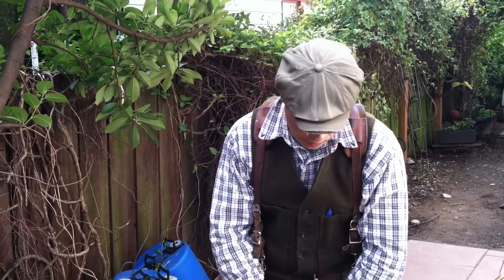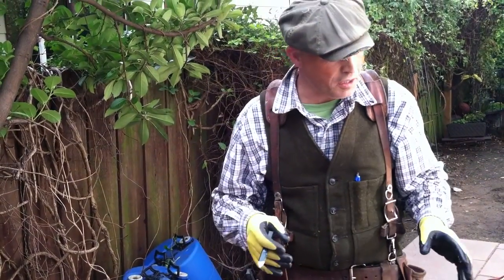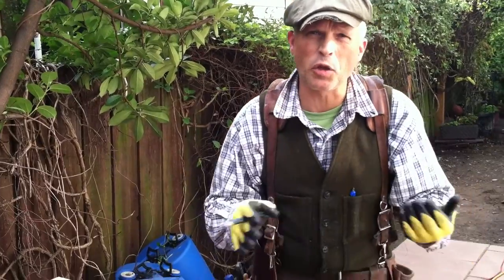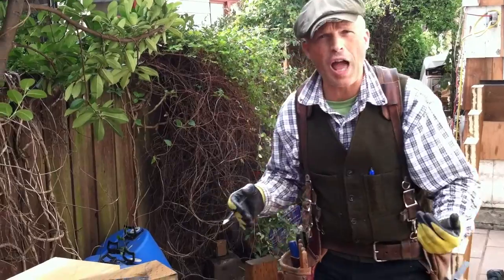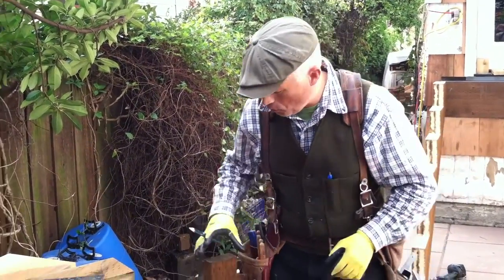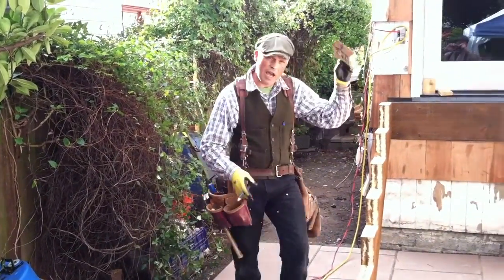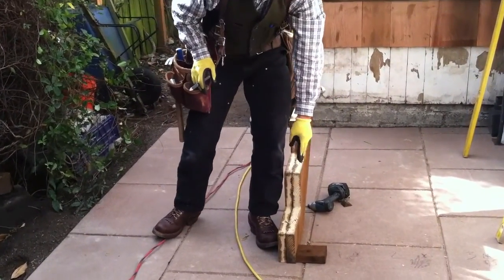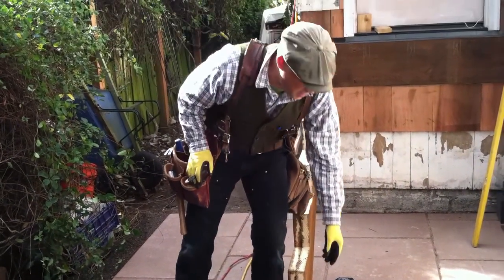Okay, now what we're doing, we have to consider securing our staircase to the patio here. Now in many cases you're going to build stairs that are going to come down onto soil, and so you'll have to pour concrete, set them on the concrete. But let me show you what I like to do. Even if I'm doing concrete, I like to have a 2x4 that is a horizontal piece laying in here. That's sort of a keyway that'll hold all these pieces together.